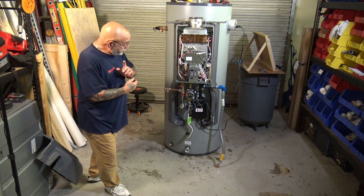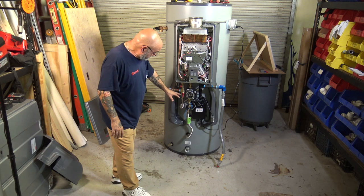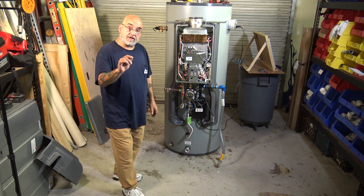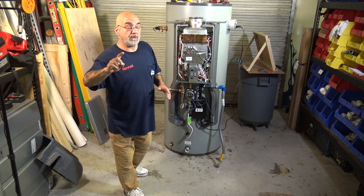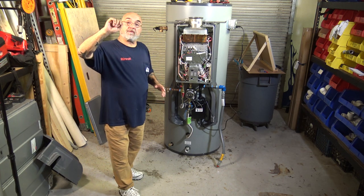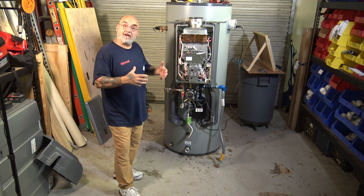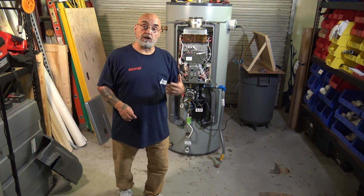All right? What should be done on these units? Again, every 3 months, do a proper service, pull the filter. Now, these demand duos, you can replace the standard white filter with a red filter. Now, I do not happen to have any of the red filters, but on the next video, I will show them to you. And actually, if you go back into my past videos, especially the one on how to remove the filter, you'll see a red filter. It's got a larger screen opening because these tanks are inherent to trap junk, and that junk gets circulated through, and on the standard filter it gets clogged very fast.